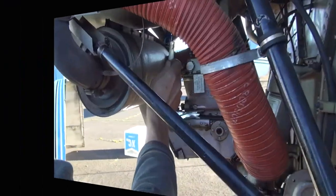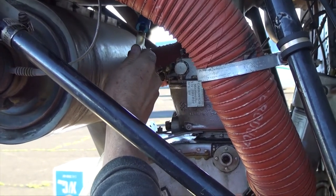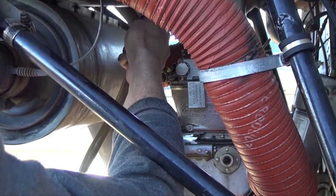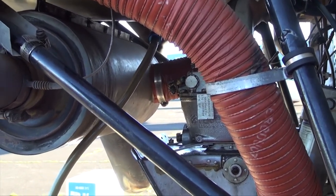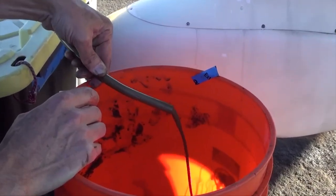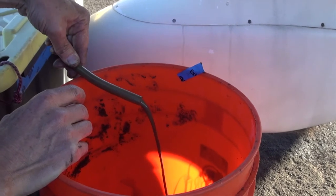That blue quick-release thing is actually the bottom of the oil pan. When you push it you start to get oil coming out, and you can turn it to lock it. There are about 10 quarts in it that are starting to come out. The oil coming out of the engine is a different kind than you'd have in a pickup truck or car — it's thicker for starters, and when it starts to get brown like this, it's time to replace it.